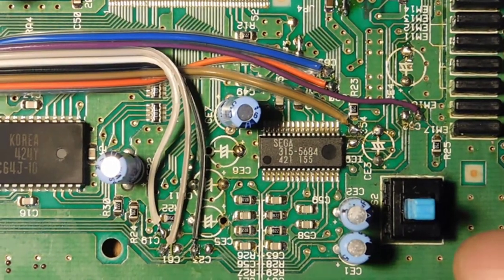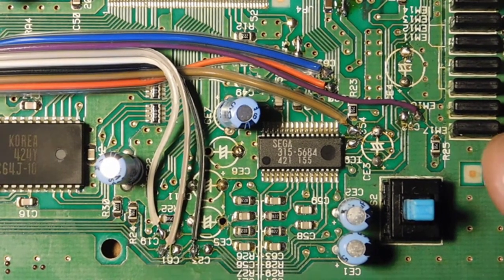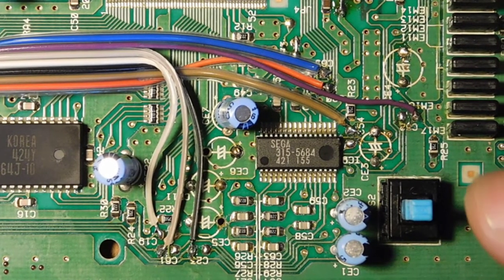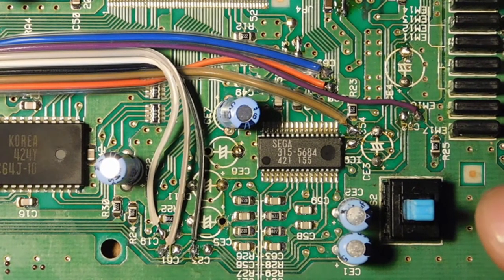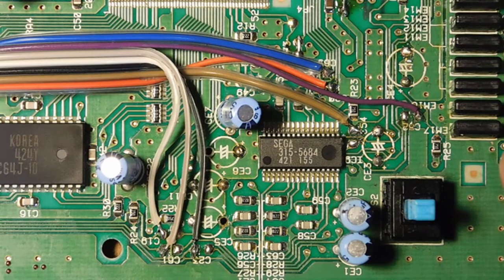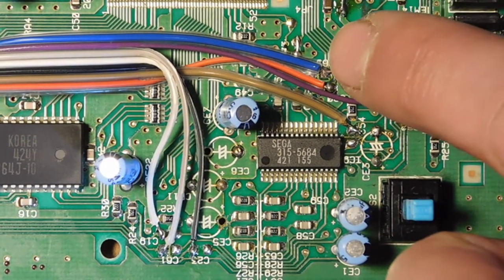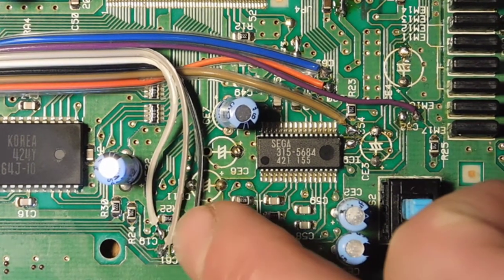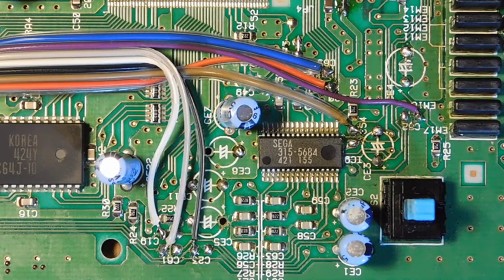Okay, so I'm all done with wiring up all of the points for audio, and I'm also going to leave a link in the description with some photos of this, because if you're trying to do this yourself with a VA3, I think it's going to be much easier to look at the photos than to necessarily pause the video. But basically, we have the X left and right up here. We've got the Y left and right over here, and then we've got the C left and right over here. And then this white wire that's up here by itself, that's the PSG sound. So those are all of the 7 points.